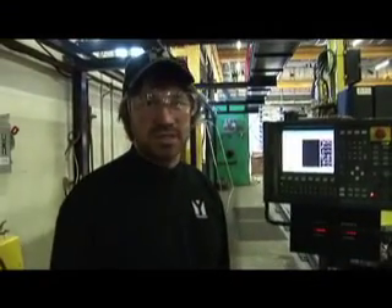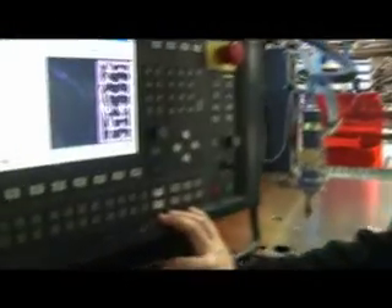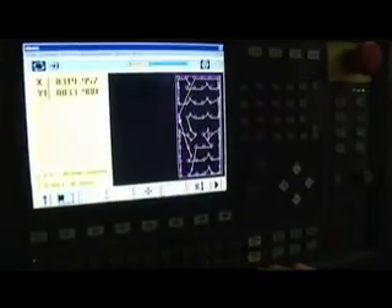The nesting can be put closer, there's less material used, less scrap. We do have the option of etching part numbers and heat numbers on the material with the precision head. As you can see, here is the sketch. There are 76 holes in this sketch and the holes are plus or minus 20 thousandths. And we're going to start cutting the job now.